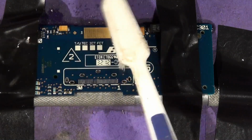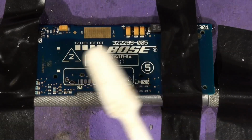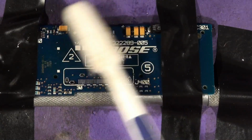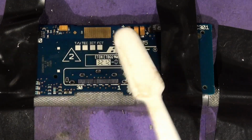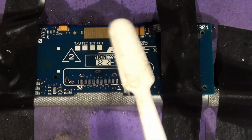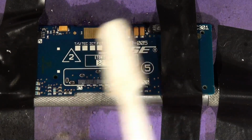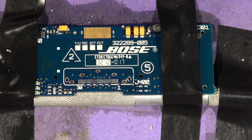Lightly brushing to and fro in a reciprocal manner. You brush for 2 minutes, do one side at a time, then give it a bit of a rinse to wash off all the flux. I normally do this over the bin, so I'm contaminating my bench just for you. And there it is.